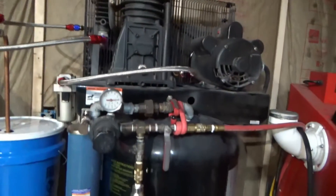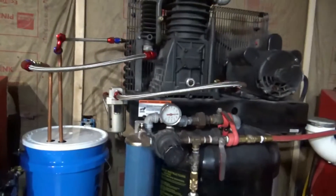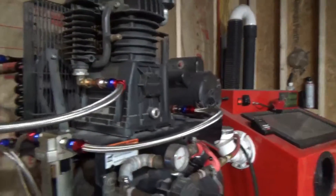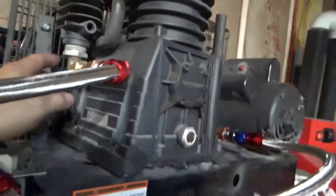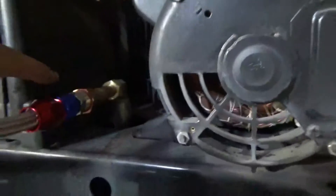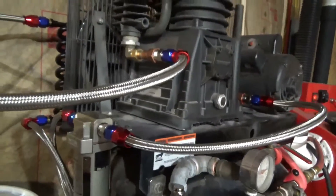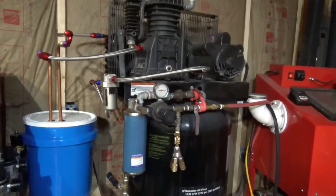I will keep you guys updated on how this works. Right now it works fantastic — no water in the lines at all. I put the blow gun with a tie wrap on it, just let it keep cycling, and it kept spraying lots of water out. Lucky on the first shot — no leaks. I'm going to do a parts list in the description for everything I used so it'll be easy. The only variable will be your compressor's output and input size — that's the only place yours might differ. Other than that, if you use all the same parts everything will be great. Thanks for watching, thanks for subscribing — get back to work!